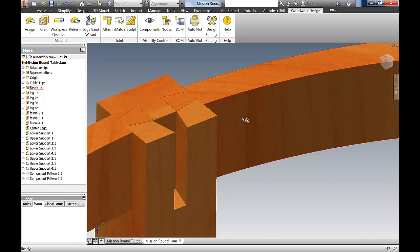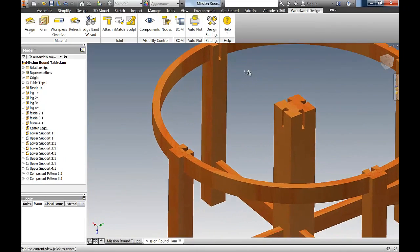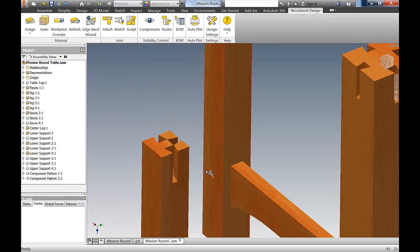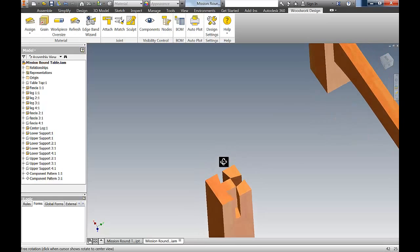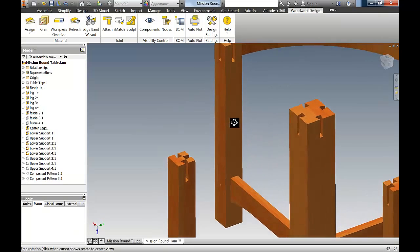So now you're taking a look at a triple dovetail joint, okay? And the strength of the dovetail and the strength of this all happens when they all go together, meaning when they're all glued up. And again, here's a joint that most likely won't even need a clamp. Basically a slight tap on a taper, hits home, it's not coming apart.